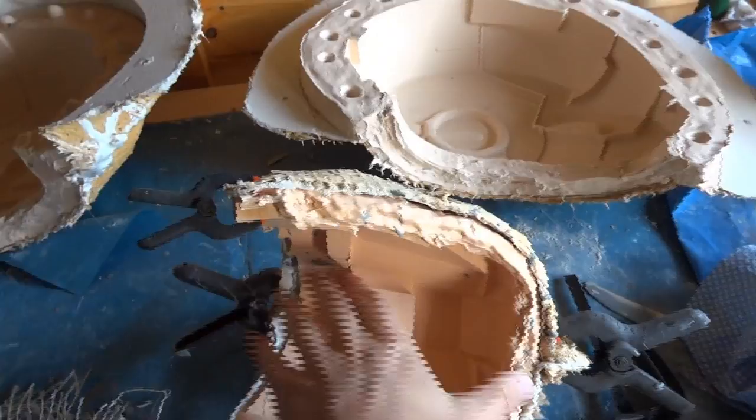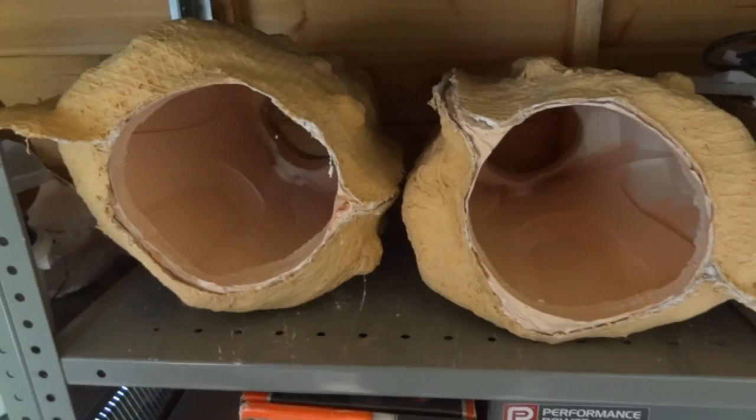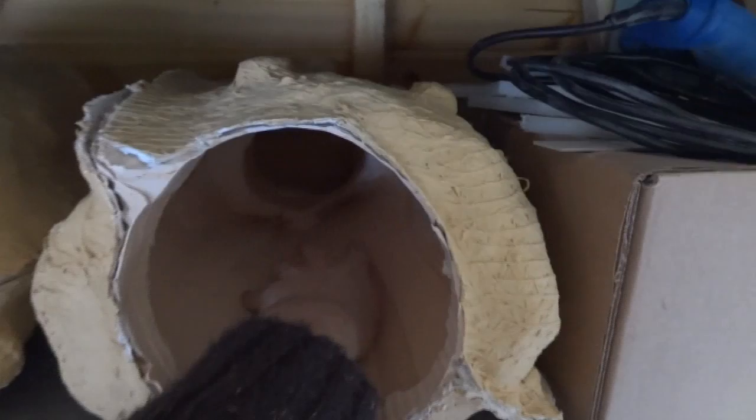So for the rest of the pieces, however, here are actually the thigh moulds. I originally intended to rotocast them in polyurethane. So what I actually did with these was only made one seam line. So the rigid support mother mould has obviously two seams, so you can get it apart, but the silicone is only split here. And other than that, it's one continuous piece of silicone that wraps all the way around, so I didn't put another seam in the silicone at the other end, which for rotocasting is fine, because you pour in the resin and you rotate the mould around, it coats the inside, and that's how you do the cast.